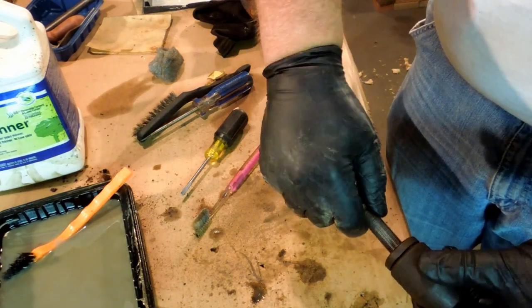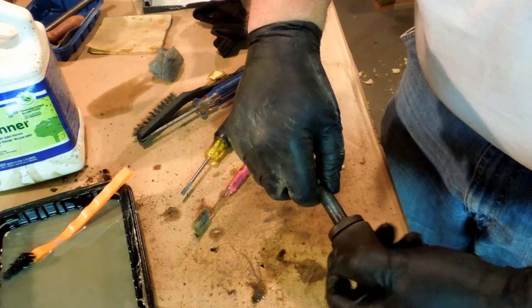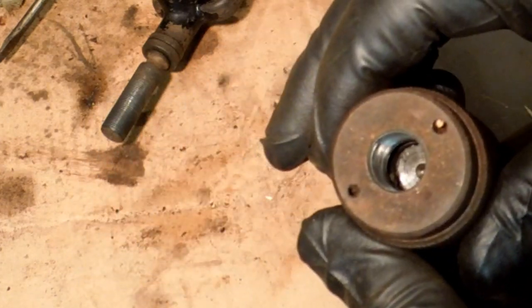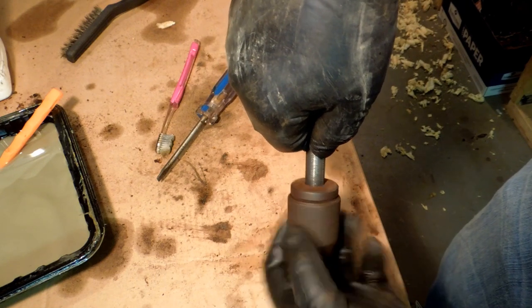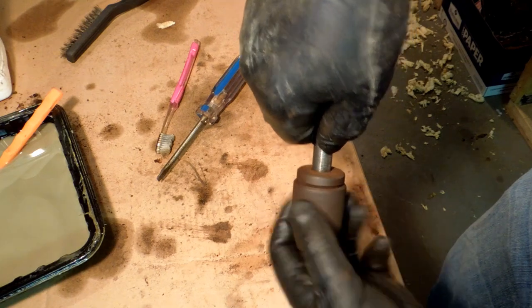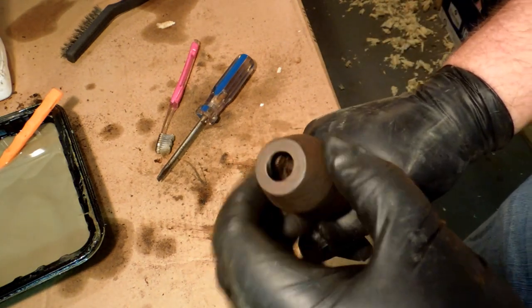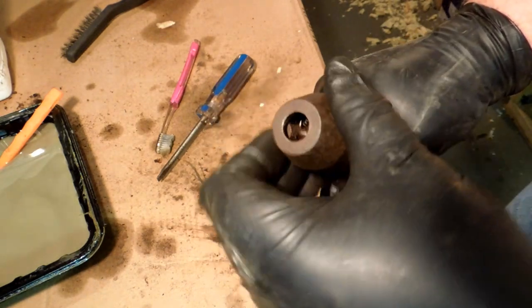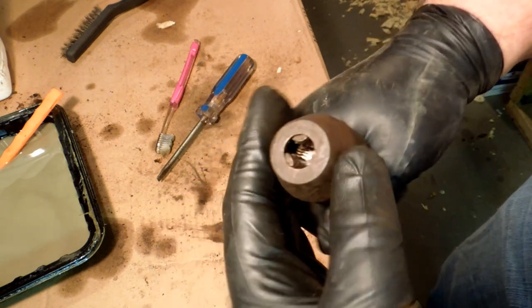The way this works, this screw goes in and pushes on a pressure plate. It's a pressure plate down inside that hole. Inside the chuck, there's a cup-shaped pressure plate that sits down over the end of this threaded rod. And once it gets down there and engages the threaded rod, as the chuck is turned onto the shaft, that pressure plate is forced up through the chuck, and it engages the chuck jaws and causes the chuck jaws to advance to the end of the chuck.